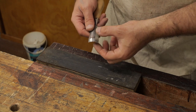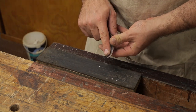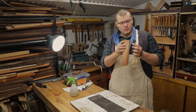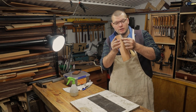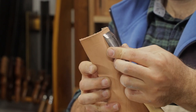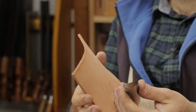You can see how shiny this bevel is — we're pretty sharp there now. I like to make sure there's no burr in the middle, and you can feel a very fine one. What you're going to want for this is a loose piece of leather. Because the burrs are small you can use honing compound on these bits if you want. The idea is you can get the leather here, roll it to the angle you need, and then strop along it. Fold it until you get the right angle, move the chisel through it about 10 times — and now that's sharp.